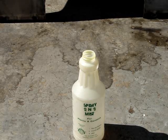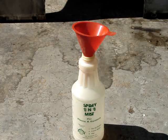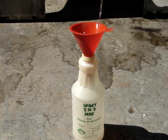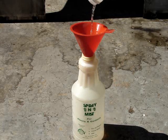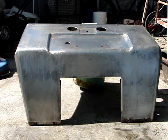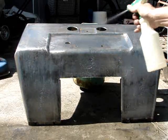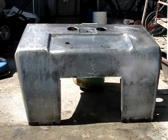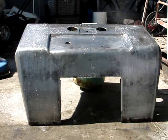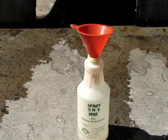The next thing you want to do is put some vinegar in your spray bottle. This step is very important — it's called pickling, just like if you were to make pickles with cucumbers. This bottle was almost empty so I'm going to pour it all in there. Now just take your vinegar and hose down the metal with it. Notice I'm doing this in direct sunlight — it actually helps with the process of the vinegar drying and will make this a lot faster and produce a better result in the long run. Once the vinegar is dried on the metal, take any remaining vinegar in the bottle and add in your salt.